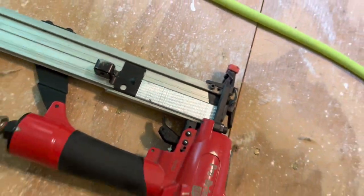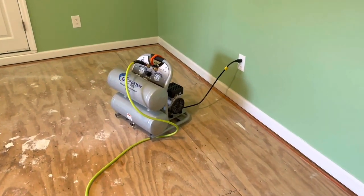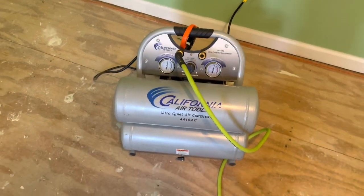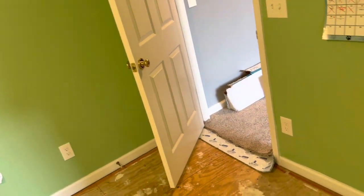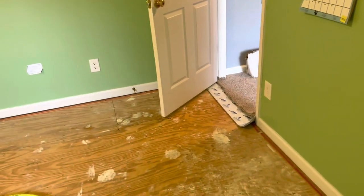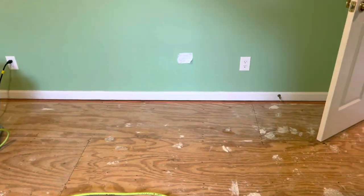You can see one-inch staples is what I'm using for the tack strip, about every two inches apart, so it holds really, really well. I've got one of those California Air Tools Ultra Quiet Air Compressors, so it's not terribly loud running that in the client's house. Whenever I'm doing something like that, I'll leave the door to the bedroom closed until I get all the noisy stuff done, or until I absolutely have to pull it — for instance, to make a seam right there. That's just to keep it quiet throughout the house so I can be respectful and get my stuff done without disturbing them.